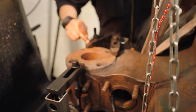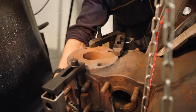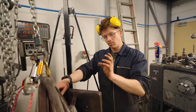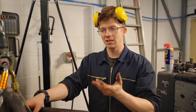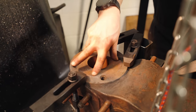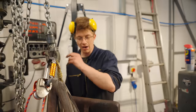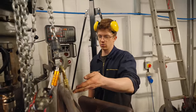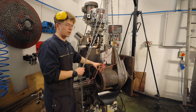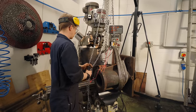Here's what we've got so far: this thing is clamped down in three spots, and underneath I have three blocks. What's interesting is those blocks don't move, which is good — that's a positive indicator that on the other side where we have this face, we have made a plane touching in three spots, so it is flat. I didn't think it'd be this easy. I want to see if this is taking enough tension to actually be able to move the table around. Let's take a little tension off. That block is tight, this one's a little looser, that one's tight. Now that I've dropped the tension down, I know that this bolt isn't doing its job.